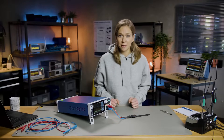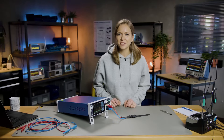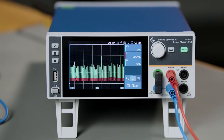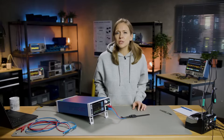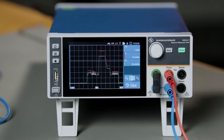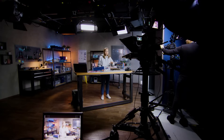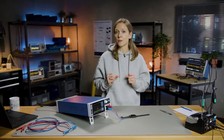How can we make sure that our power consumption measurements are precise enough? One important feature here is fast logging — a process that allows us to capture even very short peaks in power consumption accurately. If we were to use a slow logging speed, we might miss short but high current spikes that could give us clues as to the problem. A quick analysis with adequate logging speed helps us achieve more accurate results and identify those processes that put the greatest strain on the battery.